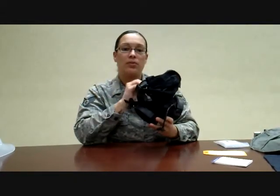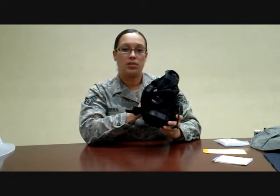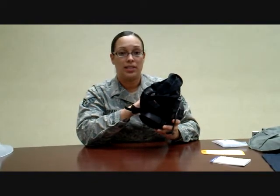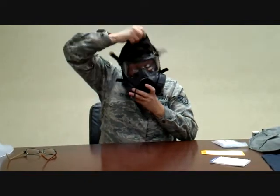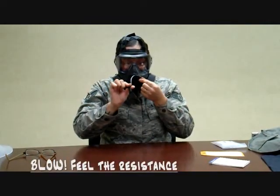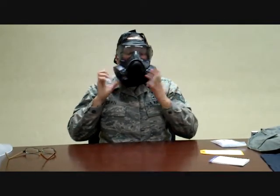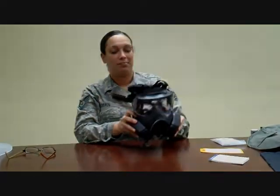You'll put your chin in the chin cup first, pull your harness over, flip your lever up to drink, and what you want to do is blow firmly into your drinking tube and feel for resistance. Then you want to suck through like sucking through a straw and check for resistance. If you do not feel resistance, that means you have a leak. And my mask has no leaks in my drinking tube.